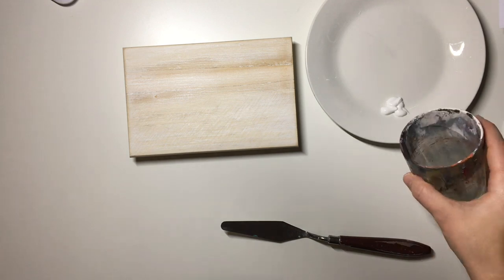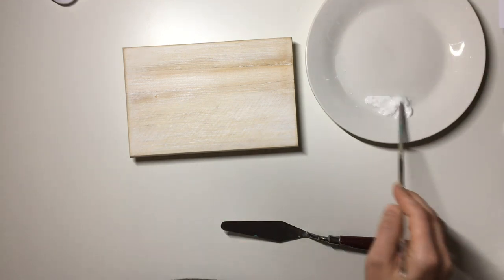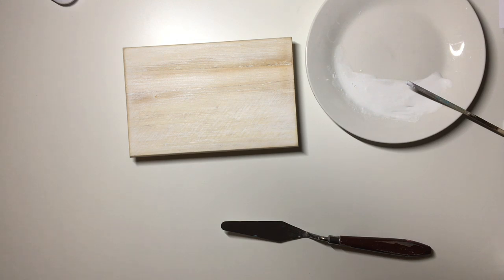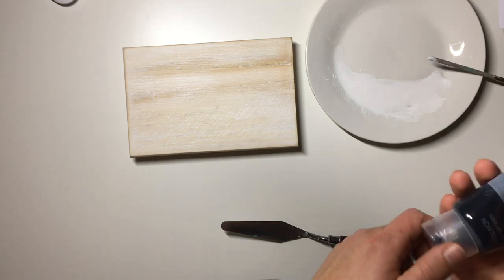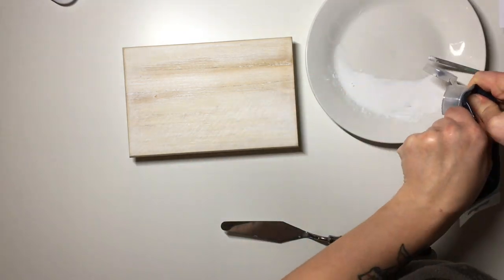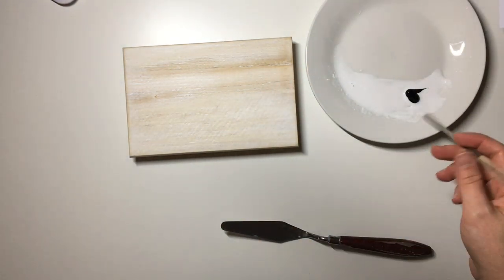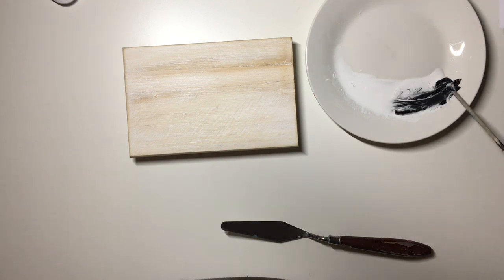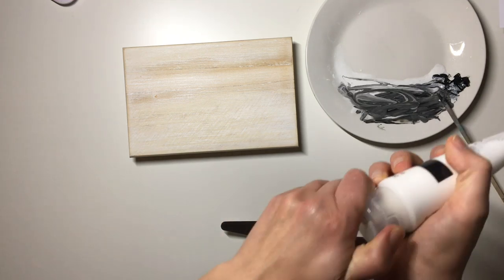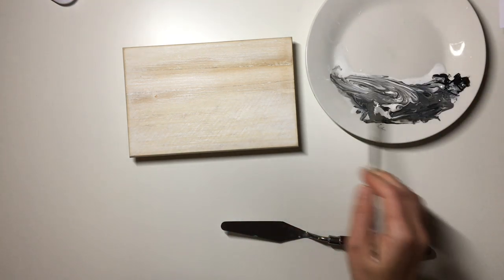After I applied a few layers of this white wood stain I sanded it down a little bit. When you work with something that is very watery it's going to lift the fibers of the wood, so the texture of the box is going to change from being nice and smooth to being a little bit more rough. I gave it a light sand and it took off some of the wood stain, which is absolutely fine. You could also do this same kind of thing with acrylic paint or chalk paint instead — just water them down.